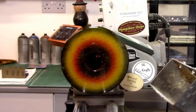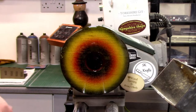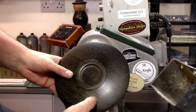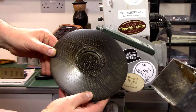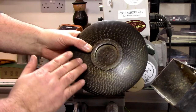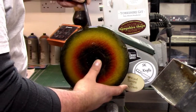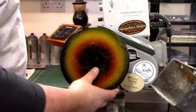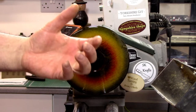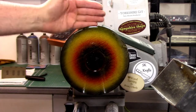So let's go over to the lathe and have a look at what we've got so far. This is the piece we did. We did the back black with the black eboniser and lacquer from Chestnut Products, and then we put some gold gilt cream over it to enhance the grain. Then we rotated it, shaped it, and carried the black on, but then we used the Hampshire Sheen Intrinsic Colors.